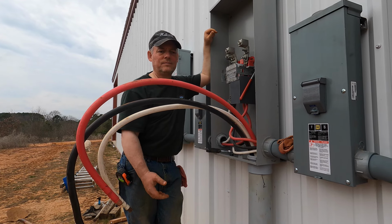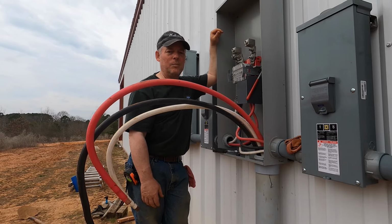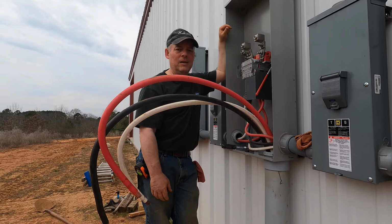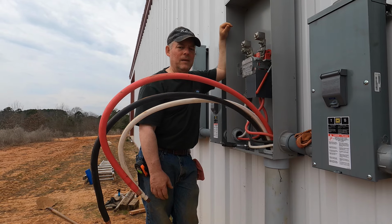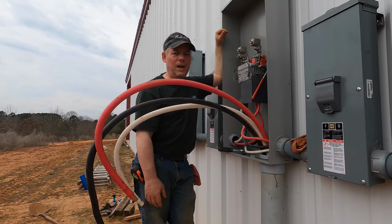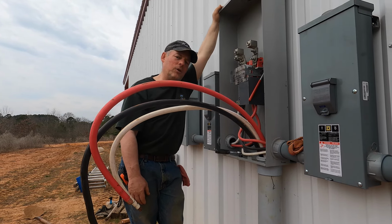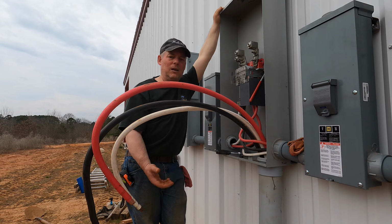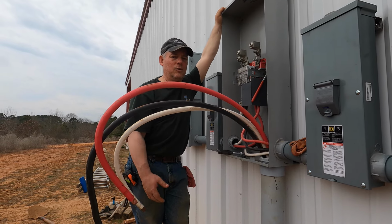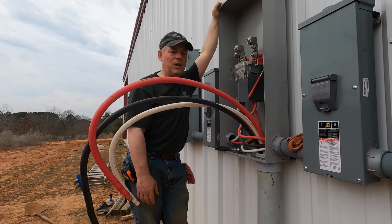And then I had to dig out all the pipe so that I could replace that portion and do it by hand, of course, because the excavator would just break more pipe. And finally got it all exposed and everything. We had enough pipe left over that we were able to replace the broken pipe. Unfortunately, I didn't have any couplers, so I had to go to town and buy a couple of couplers for it. And of course, this is 4-inch, so you can only get it from electrical supply house. Box stores don't carry nothing that big.